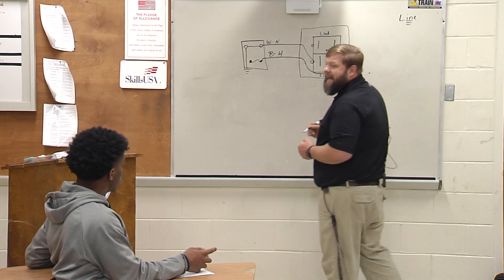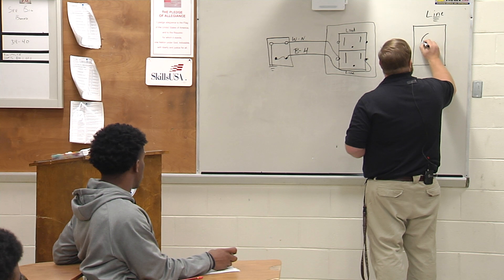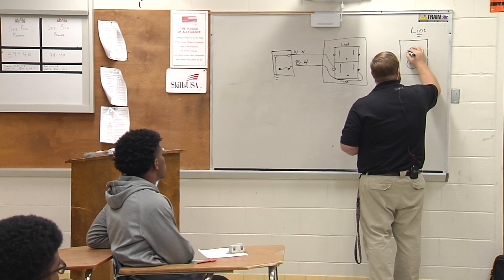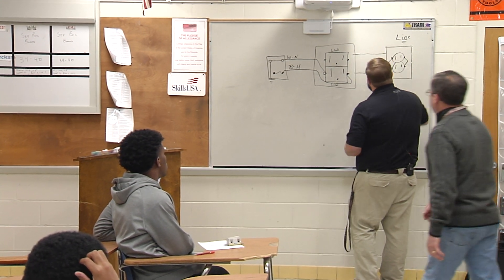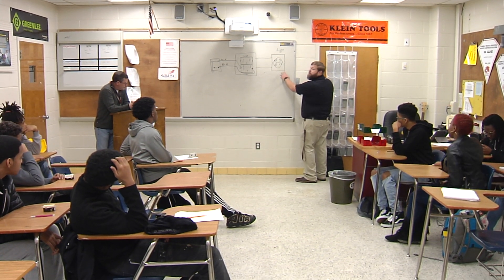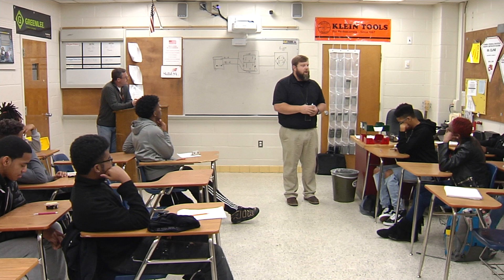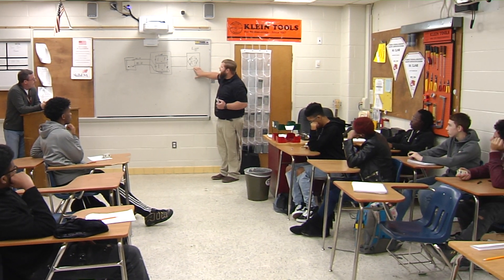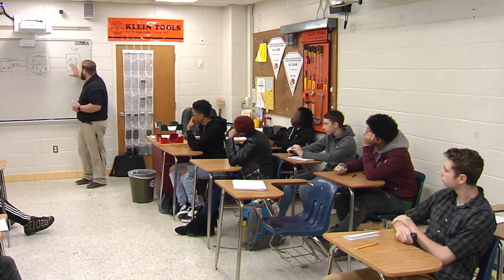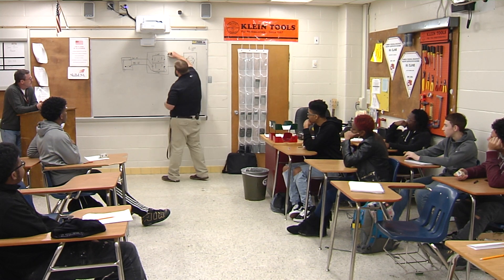You can protect up to six outlets off of this one GFCI. So if I've got another receptacle that I want to protect, draw the receptacle in — short on the right, long on the left, ground darkened on the right for hot, open circles on the left for the neutrals. If I want to protect this outlet, I need to come off of the load side. The load side is what's being protected. If I don't want this outlet to be protected, then I go to the line side. How do I put two wires under one screw? Pigtail. So if I want to not protect it, I pigtail off the line side. If I want it protected, I come off the load side.